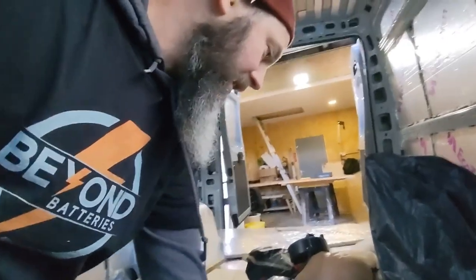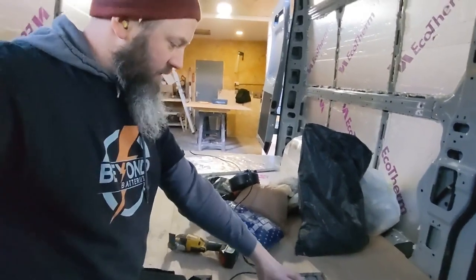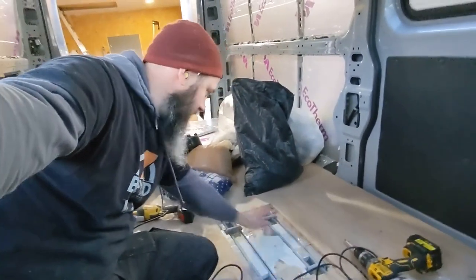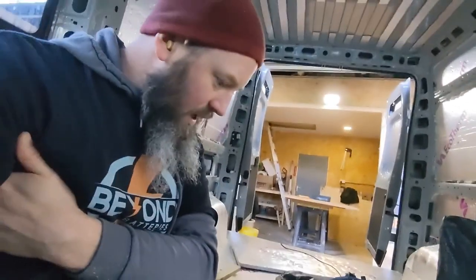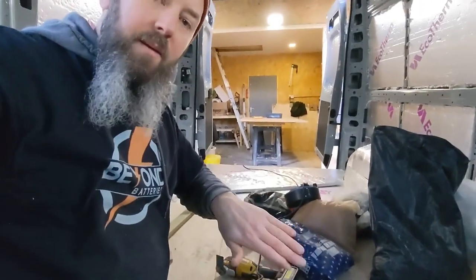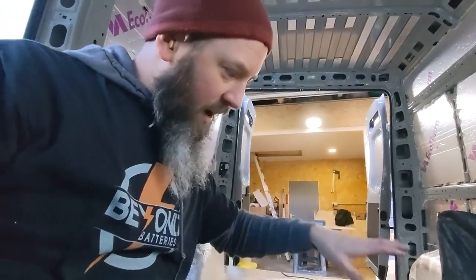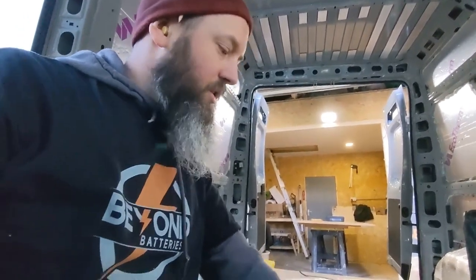I've removed this panel and I'm going to tidy up the insulation and glue down a couple more bits. Basically I'll need to make one continuous panel that fits inside here and finishes flush with all of this. I'll get onto that probably next week as it's a bit more involved — it'll require routing out a rebate and doing the same but inverse on the panel that drops in, giving a flush finish. I'll also need to work out a way to keep it down without it rattling or coming loose when you tread on it.